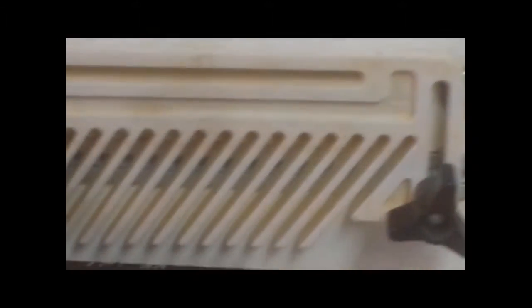Make your own. The fence that I made, very simple fence, is about 5.5 inches high, with a T-track down the middle, and the T-track is to hold the feather board. On the back, it's nothing more than what you see. Another 5-inch piece of wood on the bottom, and maybe it's 6 inches, whatever. Anyhow, just a 90-degree angle. So all I have is a 90-degree angle, and there, that's a little better shot.